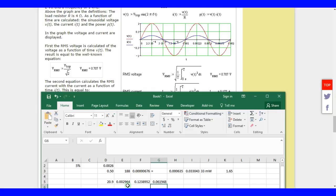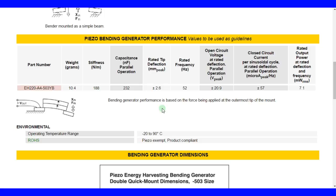This is the total wattage or total energy per time delivered to that circuit, and we're going to multiply that by 5%. And now that's 0.039, so that's a little bit closer to what they had, but in all likelihood, this top calculation seemed a little bit more solid. So 7.1 milliwatts RMS. You don't calculate watts in RMS, actually.